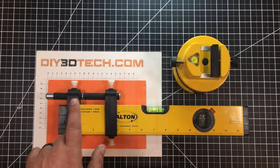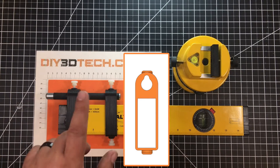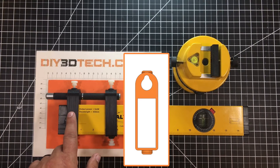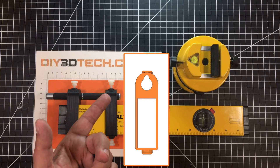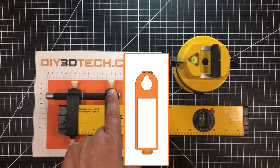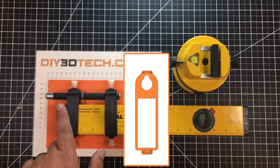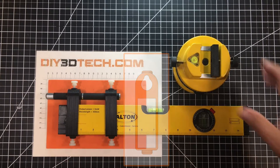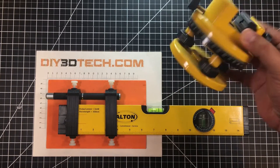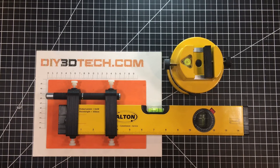With that PSA out of the way, I designed these up to receive this laser pointer, which is basically a standard size for a laser of this magnitude. I put a little notch in the top. These are the same model — I came up with one design and I'm reusing it twice, so I printed two. This quarter-20 nylon nut cinches down on the back, and this quarter-20 bolt cinches down, closes the button, and holds the laser in place. The two bolts at the bottom hold upward tension on the level. This whole mechanism sits inside a very detailed leveling mechanism, which sits on its tripod. This will easily give me 300 feet.